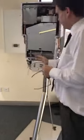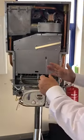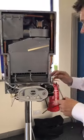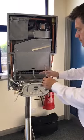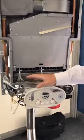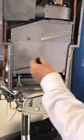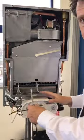Now, if you look in the bottom of the depression chamber on a boiler when you're doing a service — especially on a boiler that's three or four years old — you'll usually find with a pre-mix boiler that the bottom of the tray is clean. But if we look at an old atmospheric appliance over here, one that's been unserviced for three years, in the bottom of the depression chamber all we see is a lot of debris: wasps, flies, muck, debris — because it's all dropped in from the air intake.